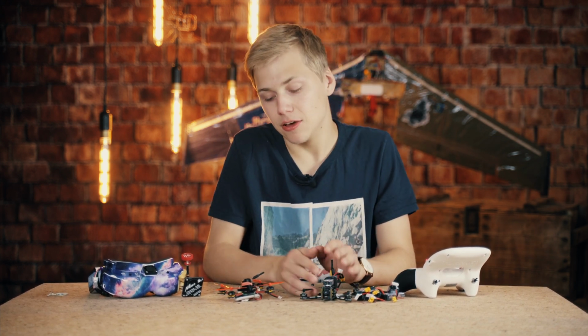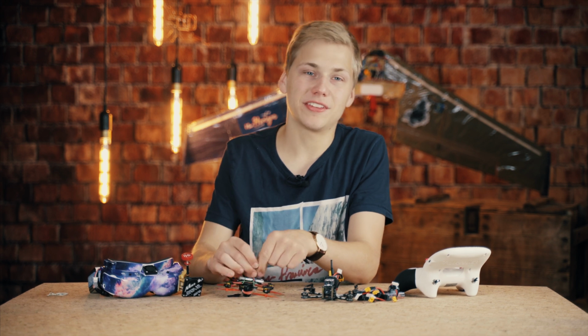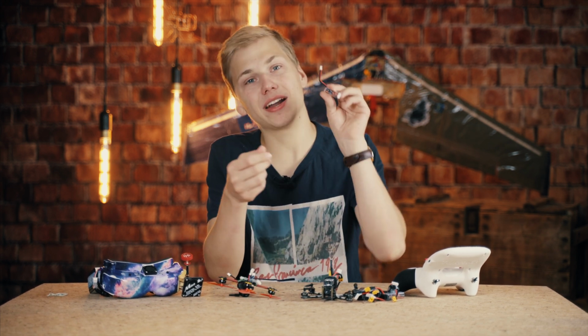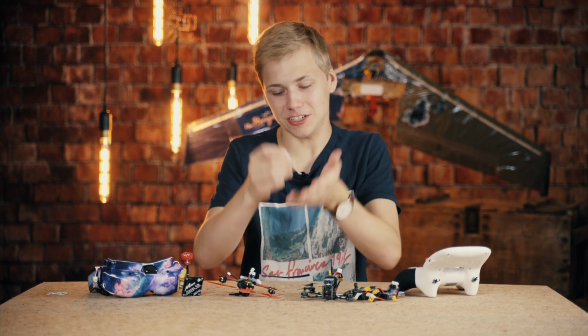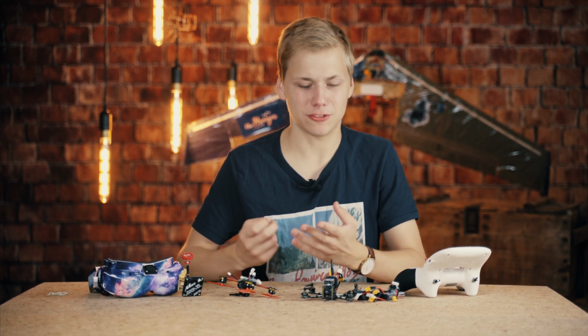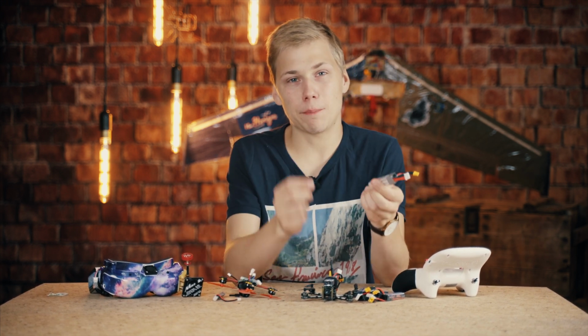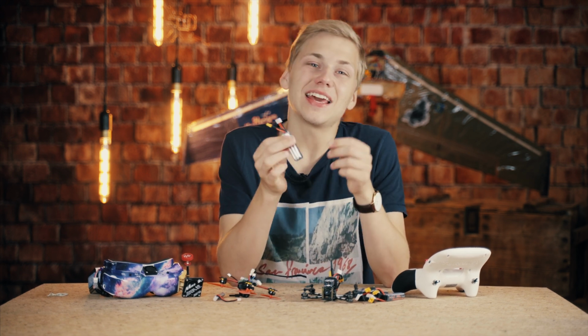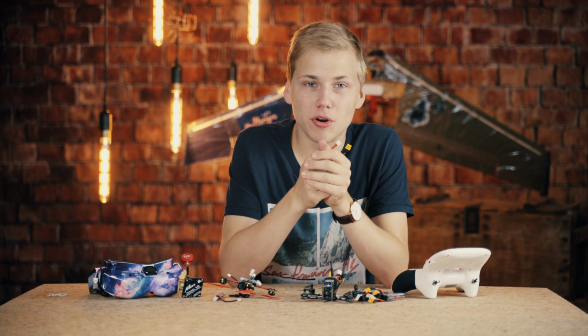The nice thing about this one is that it's smaller and it's just way more convenient with these small batteries. These 1S batteries are super easy to charge. You can use one of these Happy Model chargers. It charges 6 at a time. They're super cheap, you can get 2 of them and charge 12 batteries at a time. While with these batteries, with the GEPRC, you really need a standard charger. Sure, you could use a parallel charging board, but that's still mighty inconvenient.